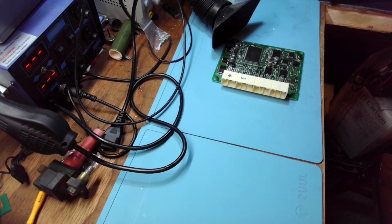There's some reason behind it: you want the machine to acclimate to your climate, so temperature, humidity, all that. Plus during shipping something could have shifted. Especially in Xerox copiers, the developer is going to spill a little bit, the toner is going to spill a little bit. I don't know most of these parts in English, but the used toner goes into a special container, and that container almost always will leak a little bit of toner.